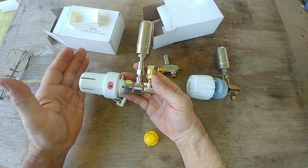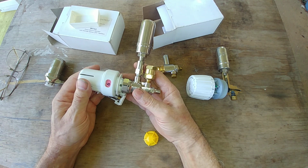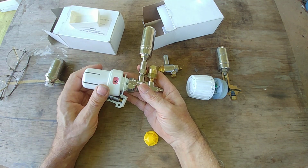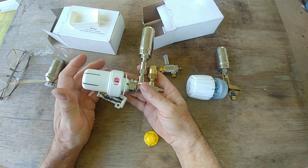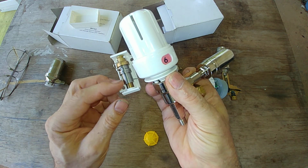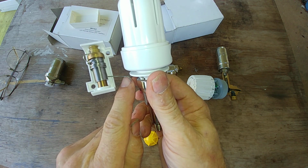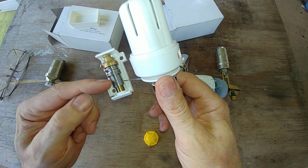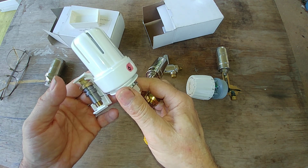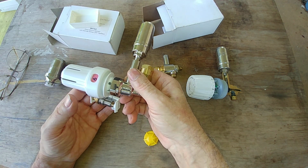But if you have a situation where the radiator is, say, encased in a radiator cover, if you have this actuator in there, this won't function reliably, because it will detect the temperature and shut prematurely, and you might not get much heat at all. So you have to have a remote sensor. The disadvantage of a remote sensor is that this capillary tube can be kinked or broken. There's a fluid inside which is contained in this sort of hydraulic system, and it's ethyl acetate, I believe, and it will eventually bleed away after a number of years and a number of cycles.